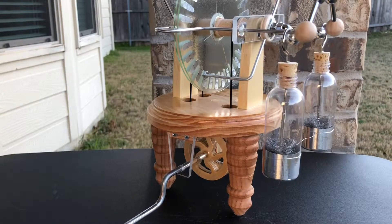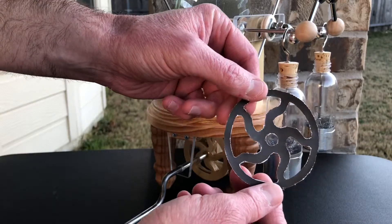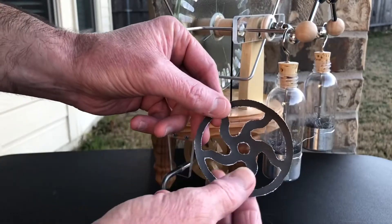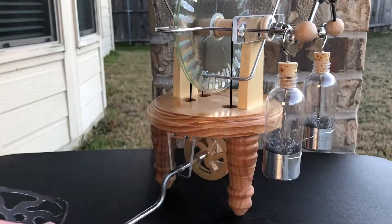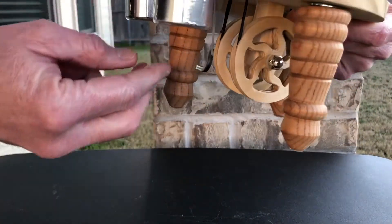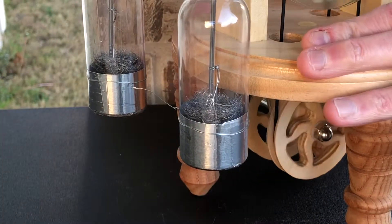This is the most stylish machine I've made to date. I took a picture of a cast iron pulley and using GIMP was able to make a black and white relief of it. I printed it out, cut around it, and then using the scroll saw cut that pattern onto real thin pieces of hobby wood, sandwiched together — the inside circles being a smaller diameter than the outside circles. The result was these pulleys, made to look decorative like old cast iron pulleys, and they turn in opposite directions at the same time.